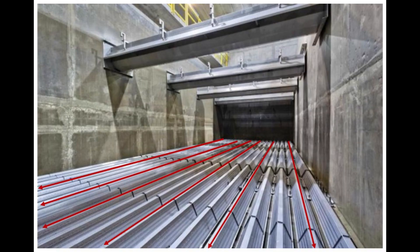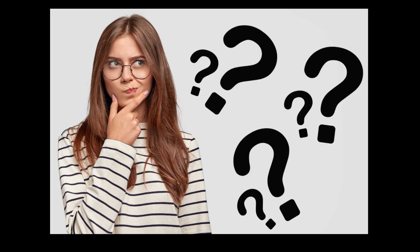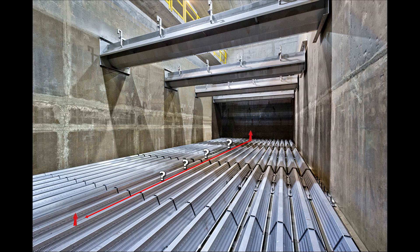Now let's think of a really long tube with holes in it. Do you really think that the same flow comes out of each hole all the way down the long tube at four GPM per square foot, then also at 22 GPM per square foot? It's impossible.